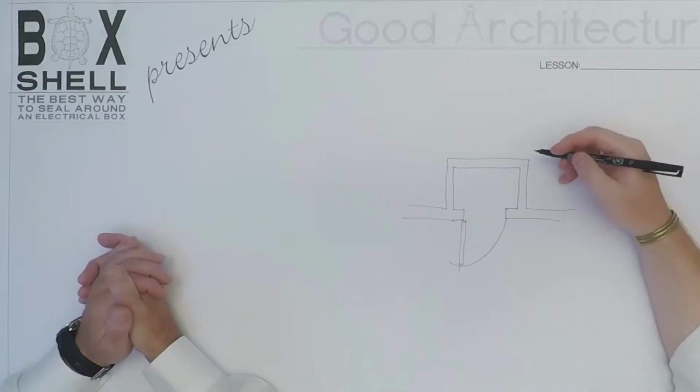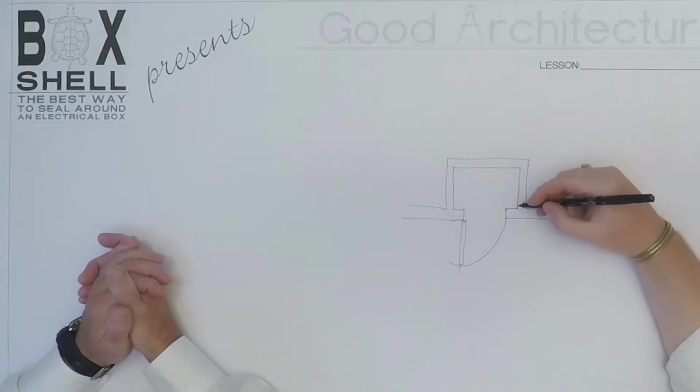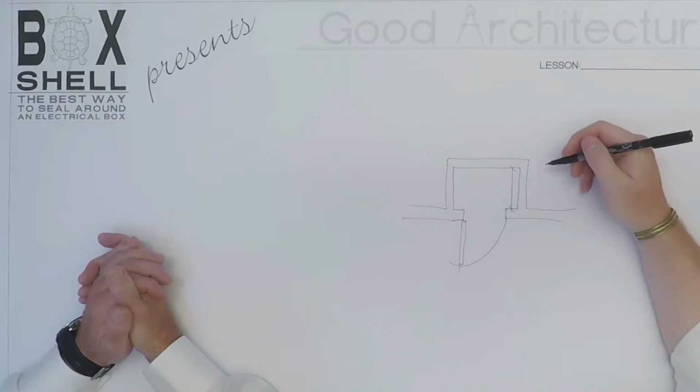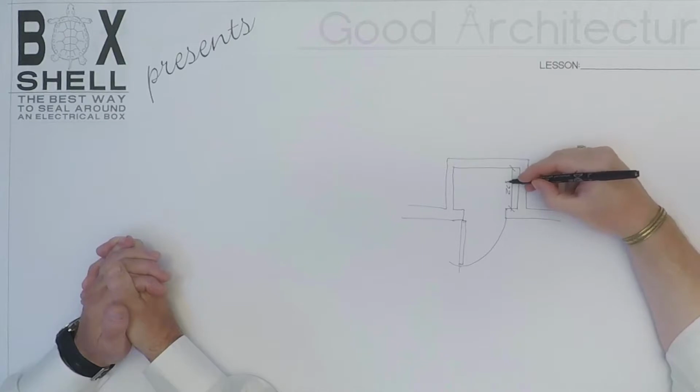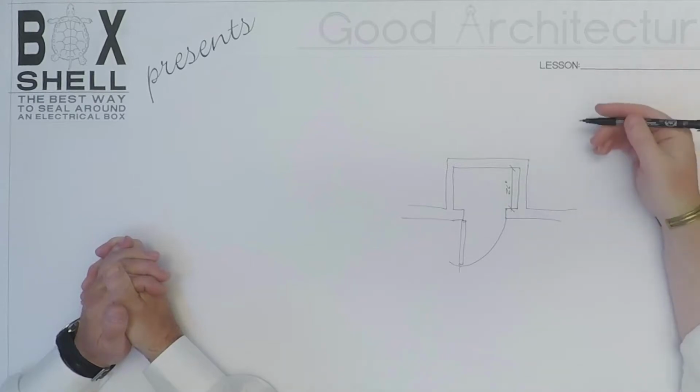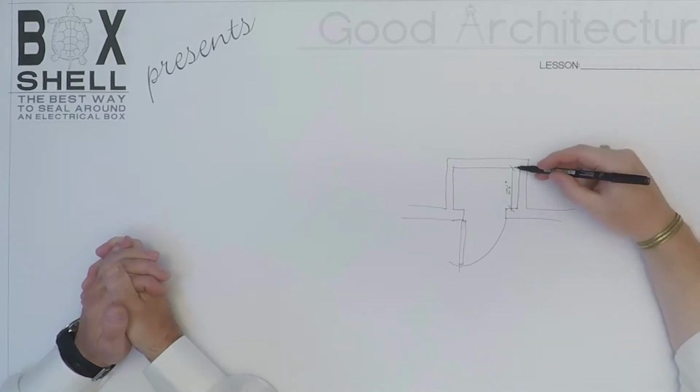Not a big deal. Really what you want to focus on is the depth of your closet, and this ranges. It could be as small as 24 inches or as large as 26 inches. Most of the time we like to do 26 inches from framing to framing. So that does not include sheetrock, does not include any finishes on the interior of your closet. It's usually half-inch sheetrock. So frame to frame is 26 inches.